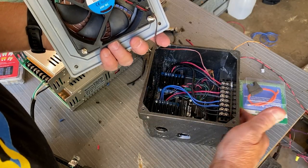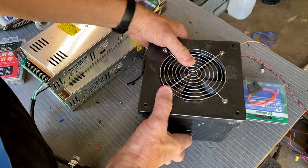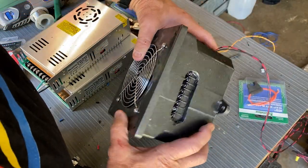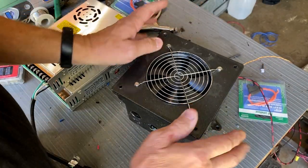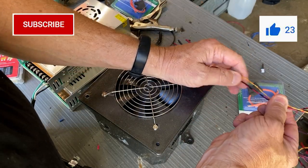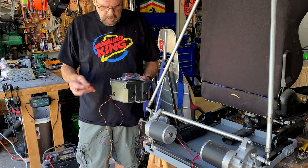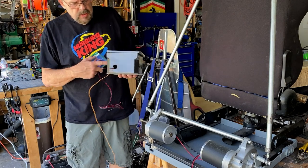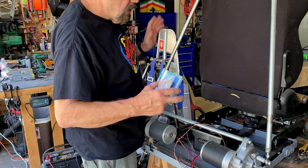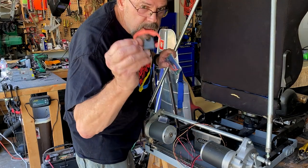The IBTs are going to be controlling motor one and motor two. We have the USB going right here, these air holes are just to pass air in and out, and here are our connectors. Coming right out the side we have voltage for the potentiometers and the reading from the potentiometers. Let's wire up the motors and the power supplies. I'm going to put these fuses hanging off the edge so you're not tracing them around, and everything should fit fairly easily inside here.